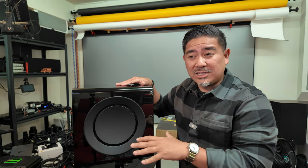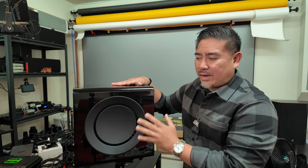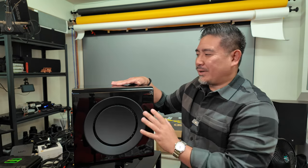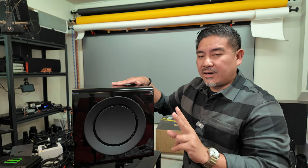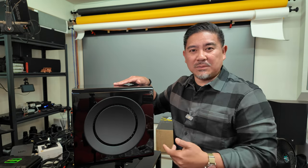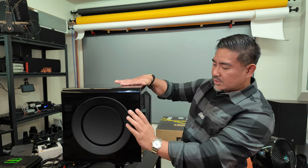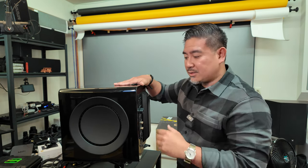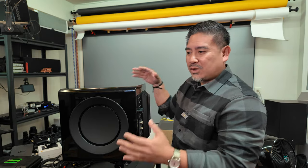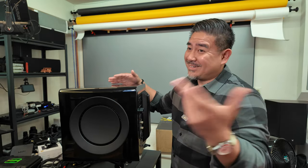I also tested it in my living room where I typically use two inexpensive Monolith THX eight-inch subwoofers. Those are pretty awesome because they're inexpensive and about the same size as this, though they only go down to about 24 Hz and don't have as much output. I'd say to anyone: regardless of what sub you get, look to get at least two, because room modes — peaks and dips in the response — can't be fixed with DSP alone, no matter how good the subwoofer is or how many EQ modes it has. That can only be fixed using multiple subs, changing the listening position, or repositioning the subs.